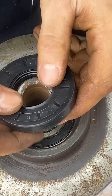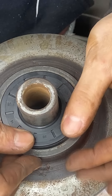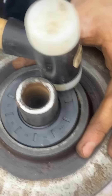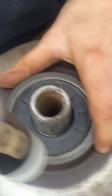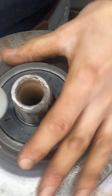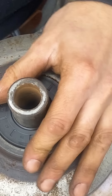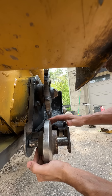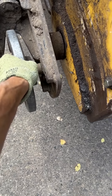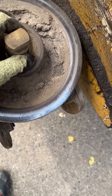The last thing on here is going to be the rubber seals. These keep all the water, dirt, and debris away from the bearings — these are what failed previously and caused the bearings to really fail. That idler is done, so I can slide it back into the undercarriage and then move on to the front idler.